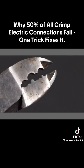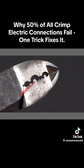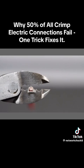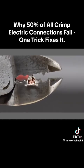Manual crimp tools like this do a surprisingly good job because they exert a lot of force. You've got one side that has that tooth along with a smoother receiver side. Let's see which way works better — here we put the seam facing up into that tooth and we'll try to crimp the connection down.